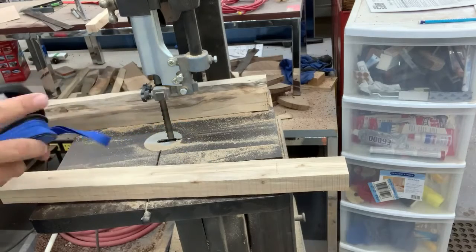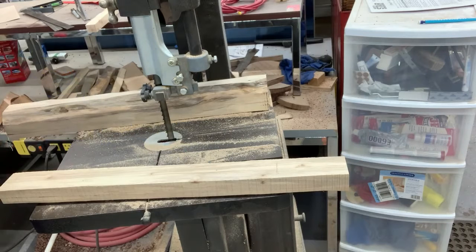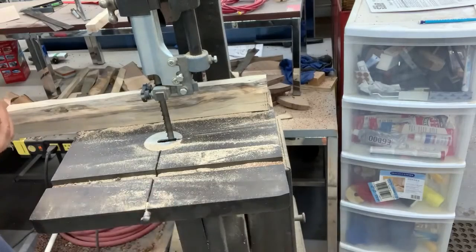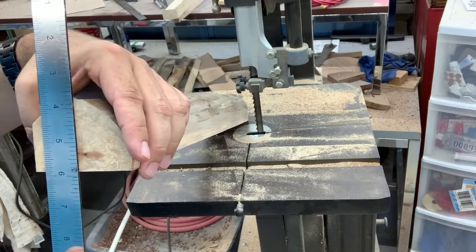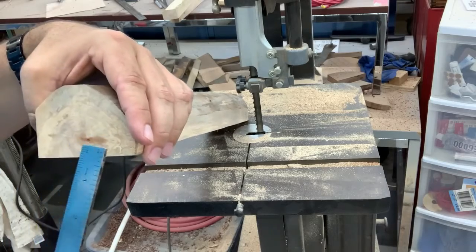I can show you that — I have a vacuum kiln that's home built. That works most of the time. It's kind of kludgy but I like it. I'm going to leave that one as is because it may warp and twist a little in the kiln, so I can cut it down after if I need to. What I think I'll do is cut right through the pith and then put it through the jointer a time or two to go a little further back.